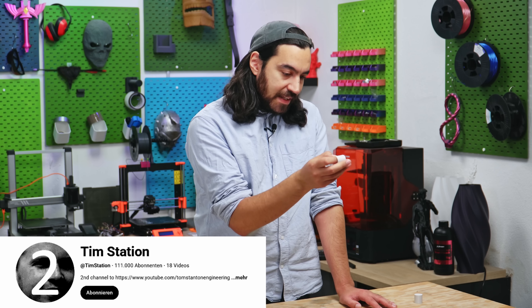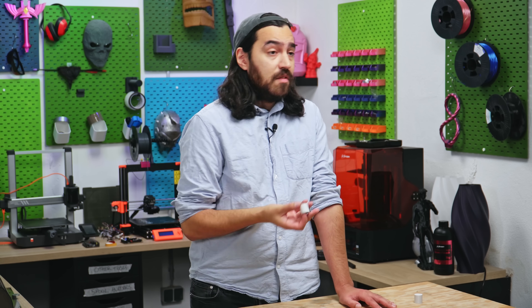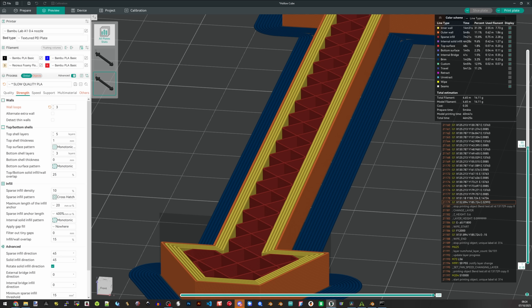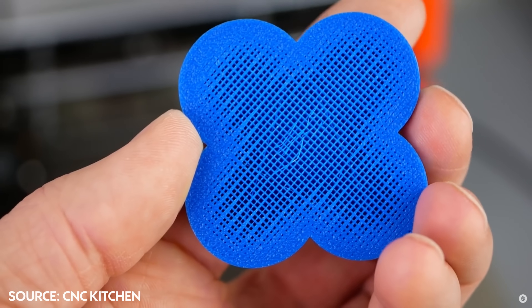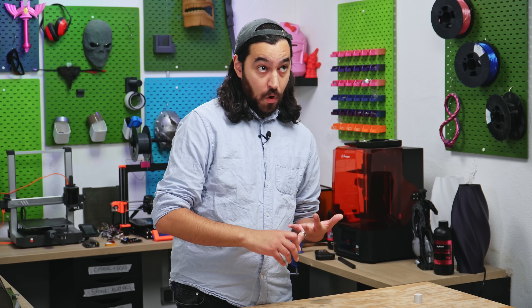Changes like these in Tom Stanton's prints basically revolve around changing the perimeter path from a right angle to a curve. It's obviously not about putting a big hole in the middle of your part. Lots of designers and engineers know about this, but most people who use a printer don't. If we look at most slicers focusing on the strength section, walls and infill, there is not a huge amount of variation in what you can do. I think it's high time features like curved inner perimeters and patterning for inner perimeters are made available. There are features suggested by the community such as interlocking layers, brick layers, and gradient infill, but these aren't actually available as one-click features in slicers. I also hope that techniques like five-axis printing or non-planar printing will become more mainstream in the near future — though these have been mostly ignored, so more emphasis on the hope part.